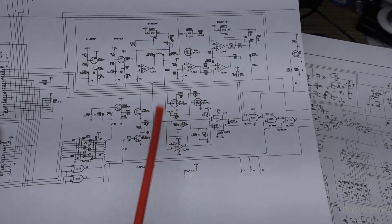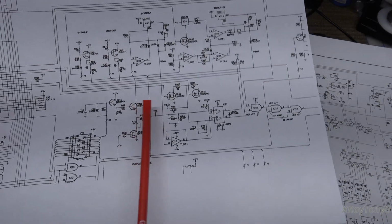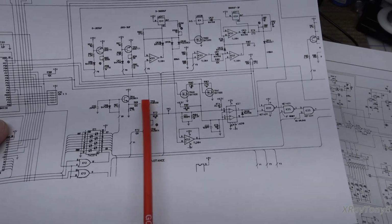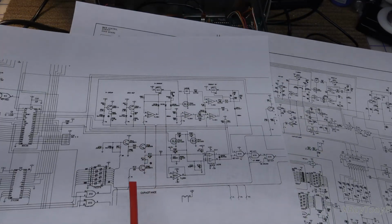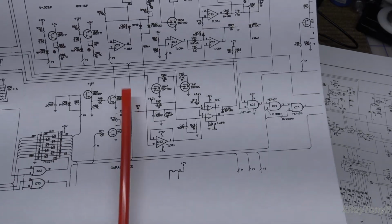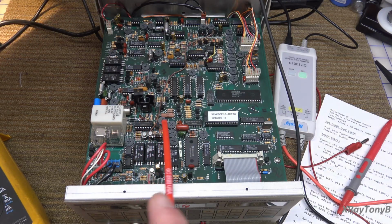This is a vertical driver transistor for television. And it's rated at 350 volts, with a minimum transition frequency of 45 megahertz, maximum of 200 megahertz. So this is a very fast transistor, and it's good for about 2 watts of dissipation. So not a very common transistor, and probably very difficult to find one of these. But again, this ECG, you can still find these, I'm sure, the NTE or ECG 120 or 228.